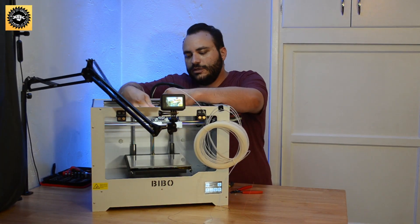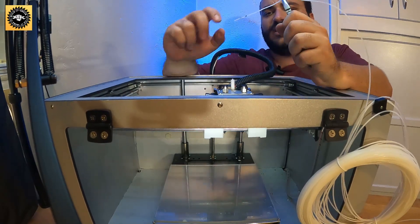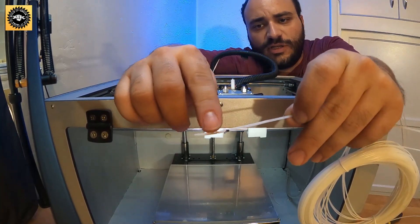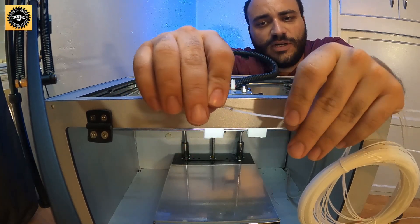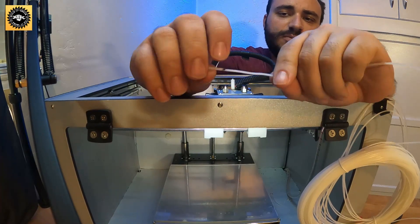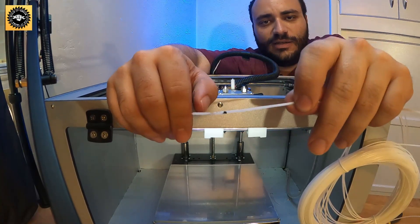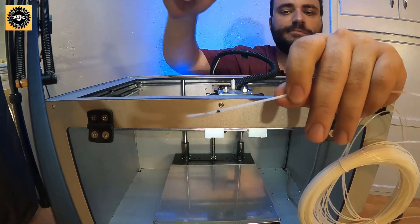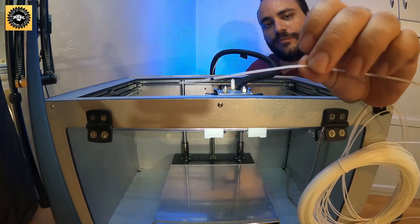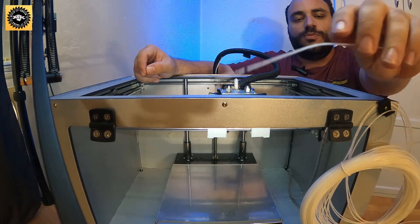We're down to about 80 degrees Celsius, so I'm going to go ahead and pull down the latch, grab my pliers, and pull that filament out. We actually did get a little chunk here — it was caught probably toward the top of the heat break. That's what was causing that resistance when we were trying to feed this in to begin with. So that was a good move. This is exactly what this stuff is for — pulling out random crap like that that gets stuck in places it shouldn't be, making your life easier so you're not troubleshooting weird things happening in places you can't really see inside of.